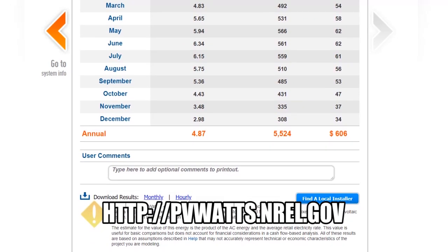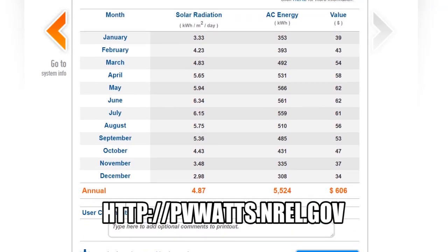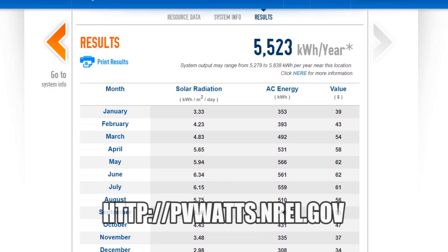When you go buy solar panels, you might look at a 300-watt panel and think: if it's in the sun for eight hours a day, that's 2.4 kilowatt hours. No, it doesn't work that way. The weather, the clouds, how much sun you're actually getting greatly affects everything. So you have to take that into account, and PV Watts lets you do that. You can say, if I bought five kilowatts of solar panels, put that into the application, and it will tell you how much power it's actually going to make in your location.